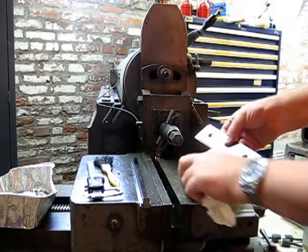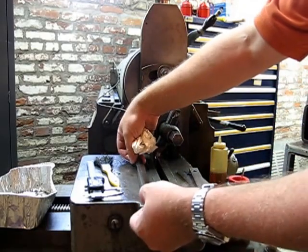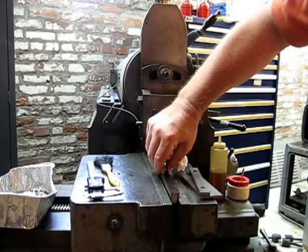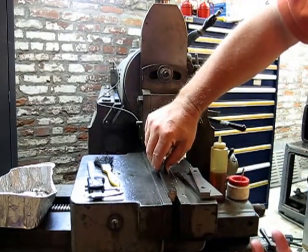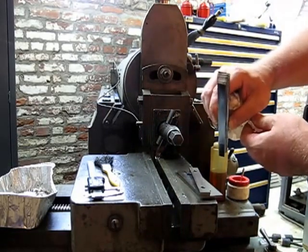Take our parallels out — I did say I had to use two sets. Take the T-nut, swap it over, and drop it in the groove right here upside down, just using the shape you just cut as your parallel, basically. Then we're just going to set the shaper up and take a big cut right across the bottom here.